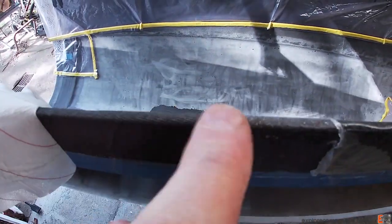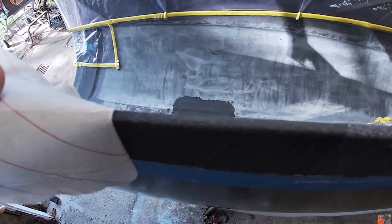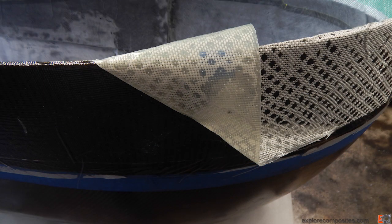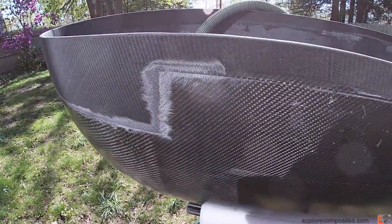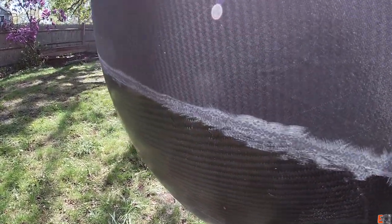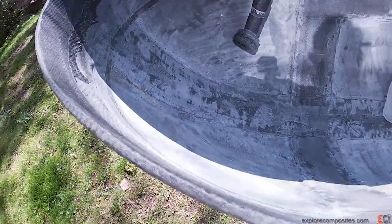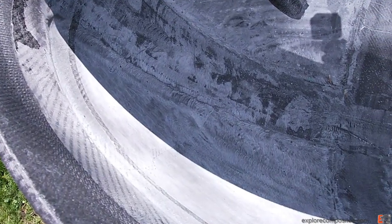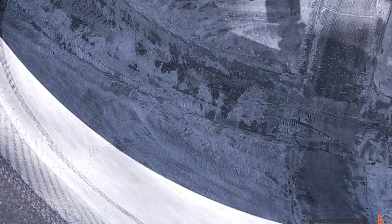I'm going to pot this edge in thick filler to make the entire bottom planar. So I pulled all that off again around the part — it looked really good. You can see how nice and smooth that is, and that covers the entire area. I brought it up a little extra to cover some of the places I'd done some damage. And on the inside, ground back — that hand-laid part got all the excess resin off. I think it made it stiffer, but it would have been much nicer to do that in one original operation.